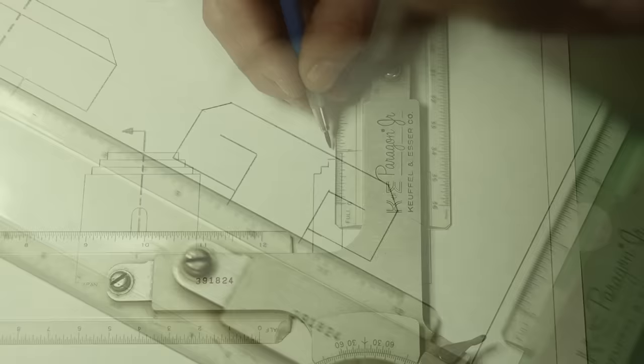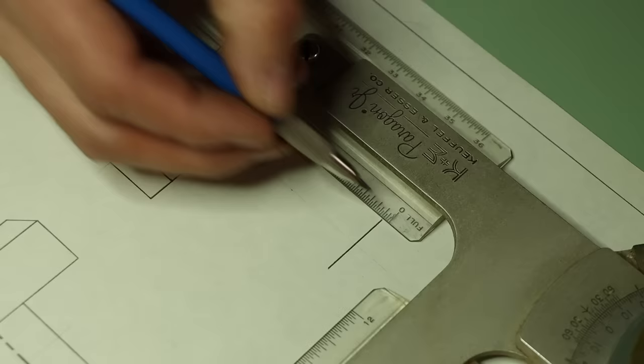The final piece of this new and improved arbor is the cap. The large end will match the diameter of the arbor and include a recessed area to clear the end of the step centering boss. Then, a narrow shank will extend through the middle of the boss and be centered by another slip fit.